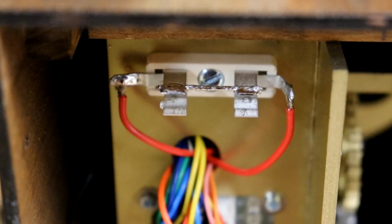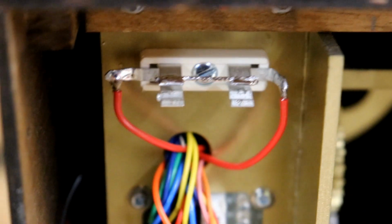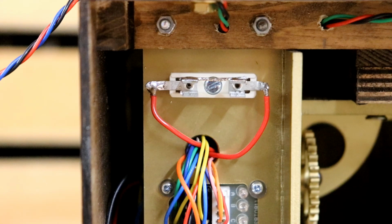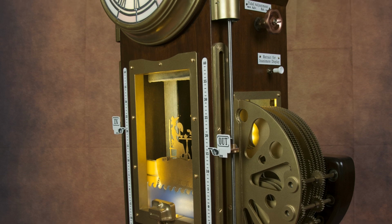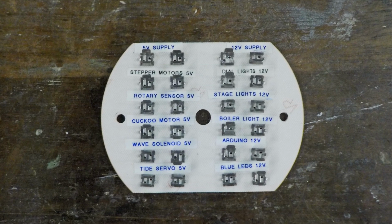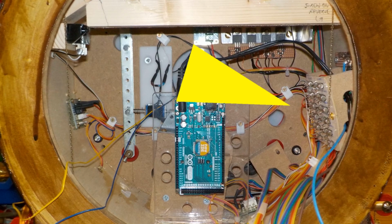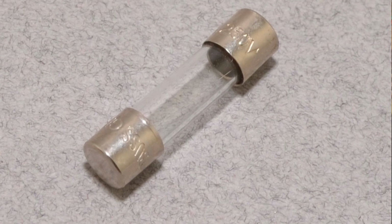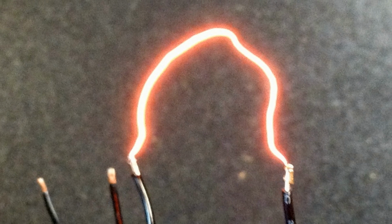My conclusion. Heinous sin, I hear you cry. He soldered a piece of wire across the fuse holder and dispensed with the fuse. Crazy. Well, having started off with a rather unnatural attraction to fuses and sprinkled them around like there's no tomorrow, I discovered, with common sense really, that they are actually like small resistors, especially the low current fuses. A fuse of, say, 200 milliamps has got quite a high resistance, it has to have, otherwise it will never melt.